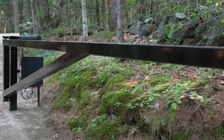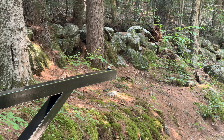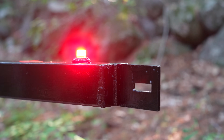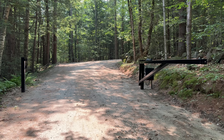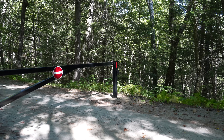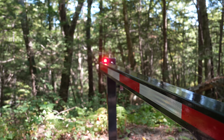Here's my solution: a really cheap 24-volt strobe light — these can also be used on 12-volt systems and are actually used inside the head and tail lights on police vehicles. It's weatherproof, so I drilled a hole and fished the wire all the way through so there's nothing visible until the very end. The gate has a 24-volt output activated anytime the gate is opening or closing, and the end result really worked out — the gate is much more visible and safer. I added safety tape and a sign to the gate as well, cheap insurance to make it visible and stop anybody from ramming it.